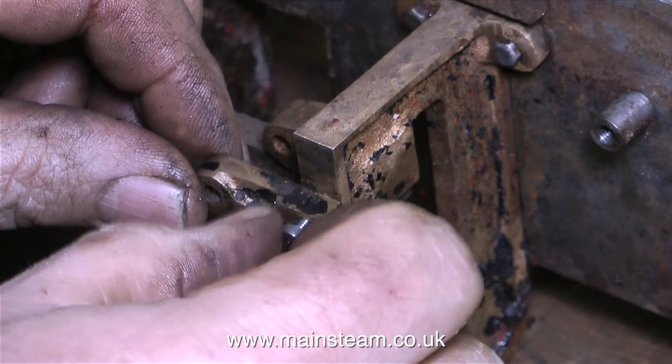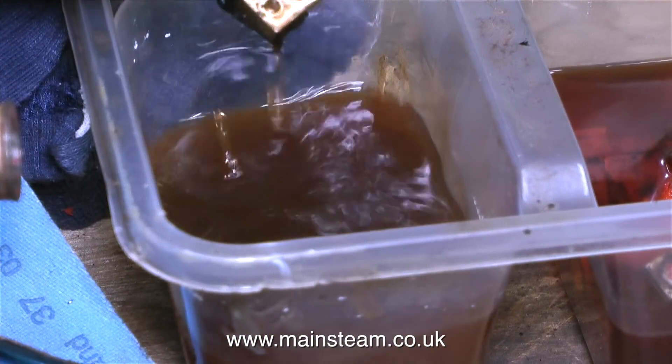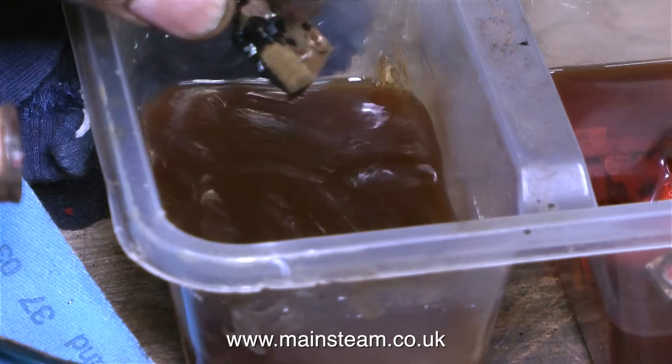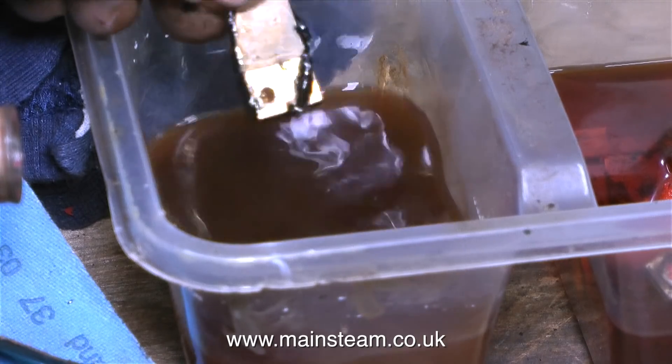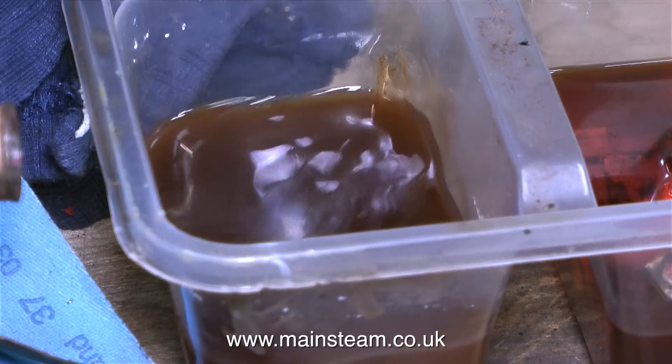And while I've been dealing with all the comments about sanding in the lathe, I've been test fitting the outer bearing to the motion bracket using some 5BA bolts that I cut to size, and now it's time to put the outer bearing into some cellulose thinners to dissolve the paint.